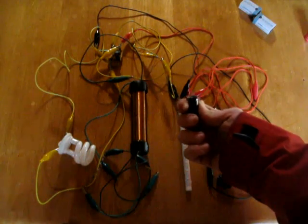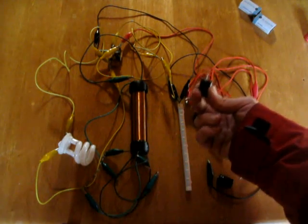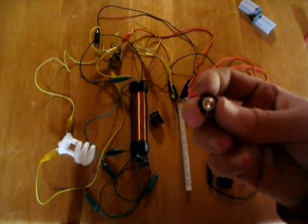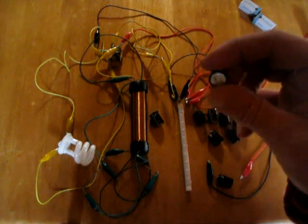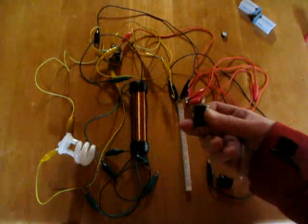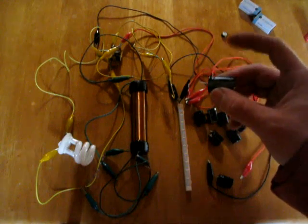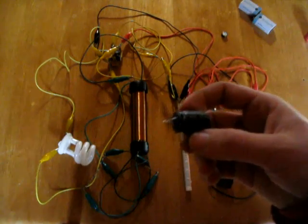It's pretty hard, at least for me, to wrap my mind around. I've got these small little electrolytic capacitors — they don't hold much in the line of power to speak of. What's interesting is I have some supercapacitors, and I'll show that in a second part of this video. But if you put a supercapacitor in here at the same voltage as an electrolytic capacitor, it will drop in voltage rapidly and not even power the light, as you would imagine would normally be the case if you've experimented with joule thief circuits. But in this arrangement I'm able to take a little bit of the voltage and current and get it ringing and resonating within the system, and it just keeps going and going.